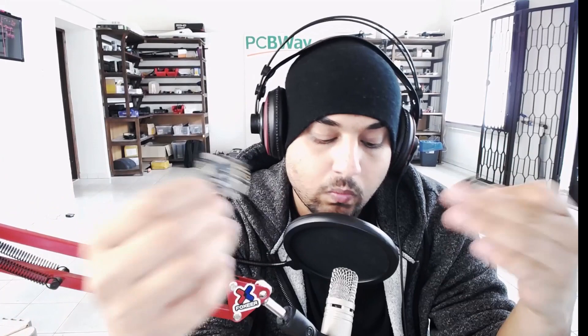You can use two types of boards: you can use a 16x16 or a Crazybee-type board. So it could be either this one which we'll take a closer look at on the bench in a bit, or one of these — this is a 16x16 and this is a Crazybee board. Both of these have their pros and cons which we'll discuss right now, including weight, power, and repairability.